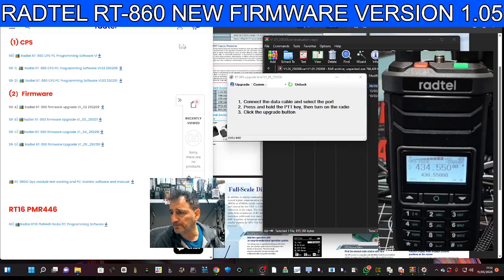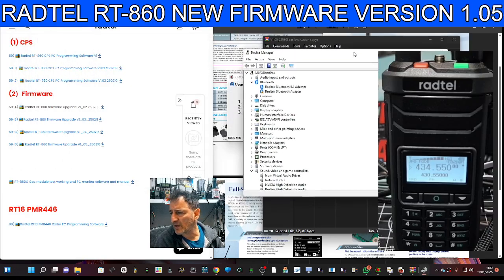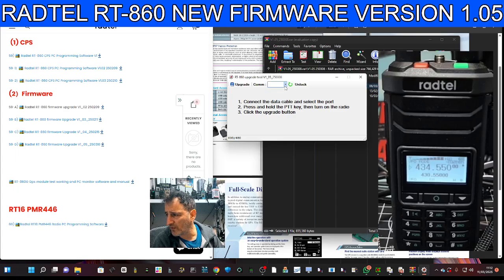We need to get the right COM port. Right-click your Windows Start button, open Device Manager. Mine is actually quite high — you can change your COM number — but in my case it's COM 63: USB to Serial COM port 63. So we know what the number is.